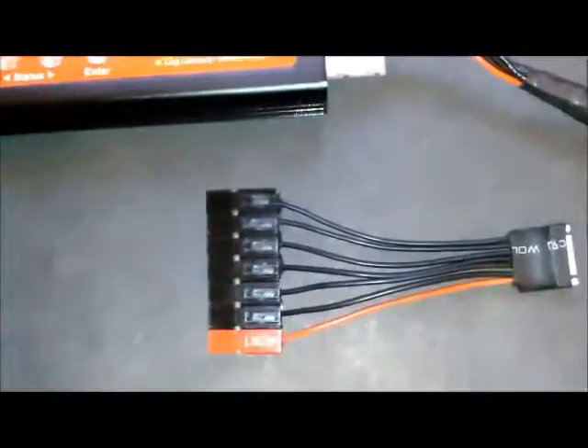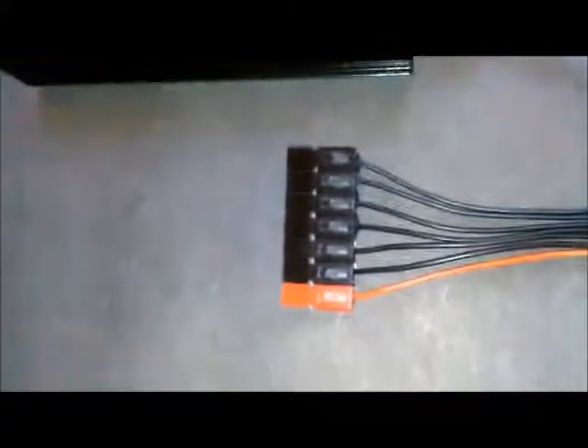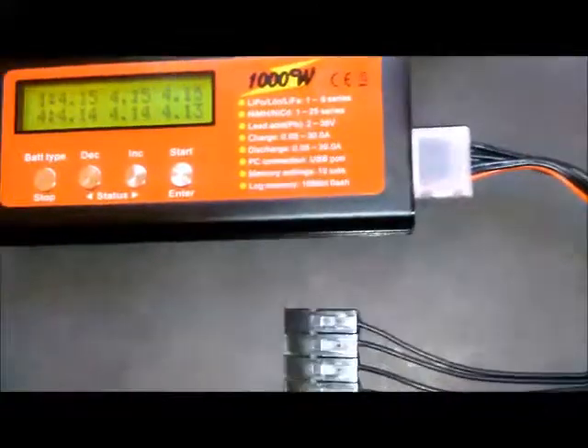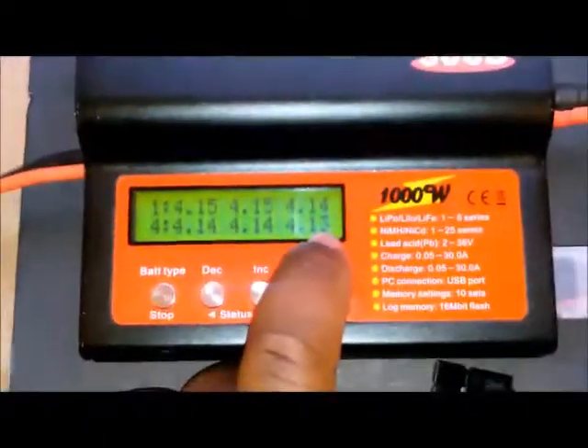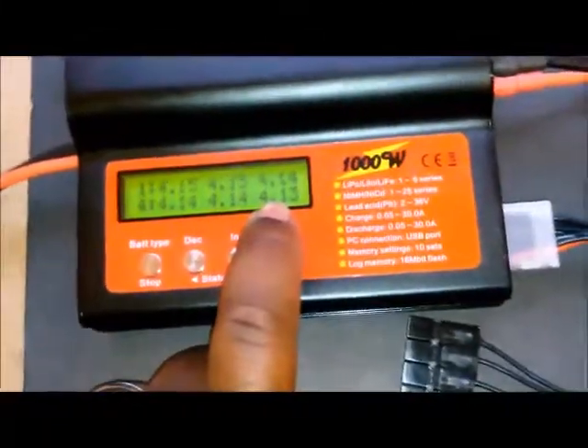You can just single charge one of the cells and let the charger throttle it. The cell has a specific characteristic that the closer it gets to the constant voltage — basically the closer it gets to the fully charged cutoff — it stops accepting current. So there's a natural taper off of the current toward the end. I still have this one cell that's lowest at 4.13, but if the voltage is at 4.15 charging, there's very little current flowing to that one cell.